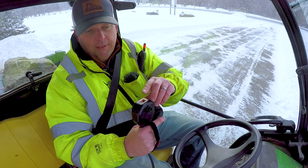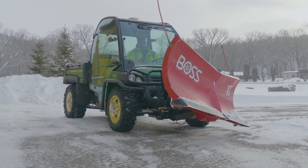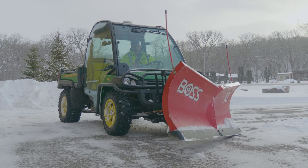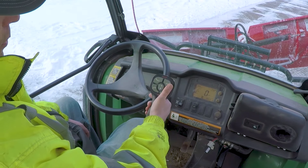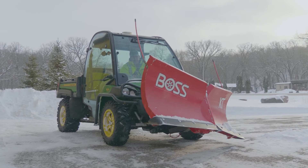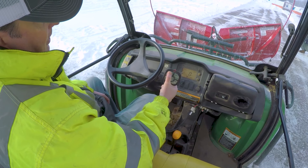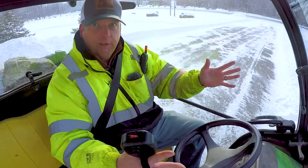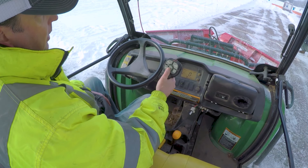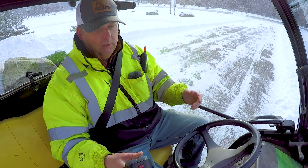On the controls, there's just an on/off switch on the top. If I push up it raises the blade all the way up, and if I go down it drops it. To swing the whole plow, push both buttons down — that goes all the way to the right or windrrows it to the left. Then you've got individual controls. For a scoop, push both, or individually control each wing. You can also bring both down into a V formation — really handy for trail clearing just the width of the gator.